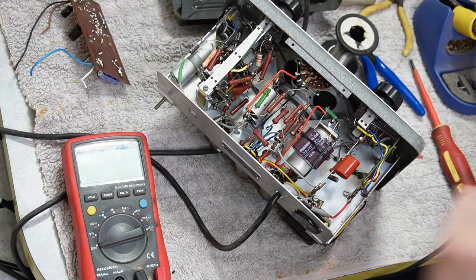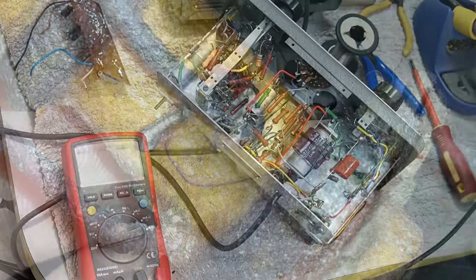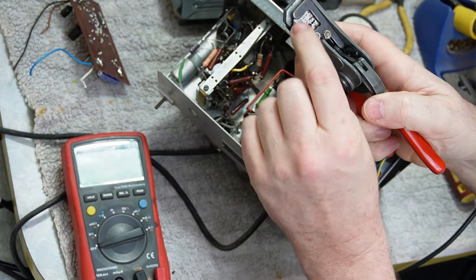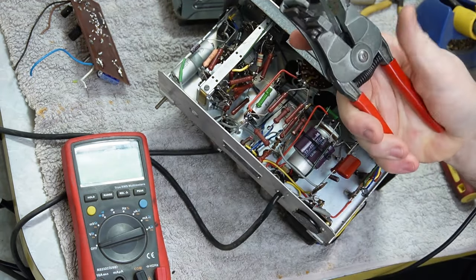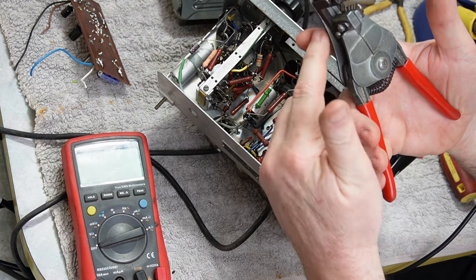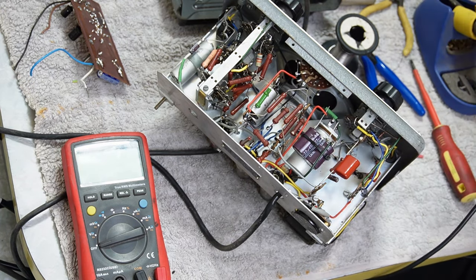from the IF coil. Now the wires, I'll put a photo if I can find one, but the wires are basically standard insulated wire that is stapled to the wooden former, and then after the staple the actual Litz wire is soldered to that, and then it comes off and goes to where it's going. Now these are great because this jaw clamps the insulation, the blades bite into the insulation, and then as you do this, the insulation's held and the snipped insulation is just stripped off, and then it sits there and pops back. Now one thing that I do reasonably often, this finger sits behind it, and as that pops back in, it'll pinch me right there and make me say rude words.